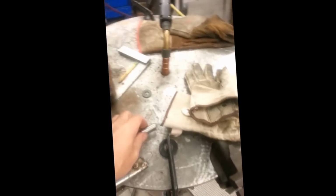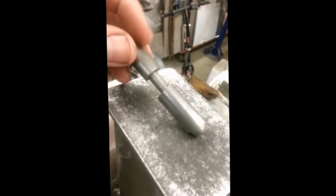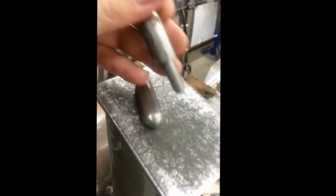Okay, so I fabbed up a little top plate. Got these weld-on hinges, a couple of these kicking around the shop, so going to weld these to the top plate. They're pretty simple. They just pin that you weld to one side and the other, and then I'll weld a little tab off here so that it can't fall off, but then I can bend the tab back if I ever need to get a jam out of this thing. Then I can take this entire top plate off. So I'll make it removable. But it's a little forward weighted so that it's got a little bit of overhanging weight on it. Should sit something like that. Then I can tip it up and just drop it. The weight of itself will drop.